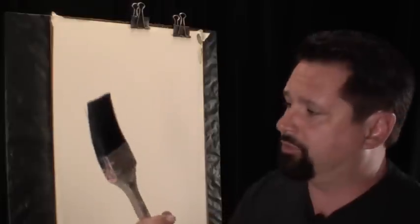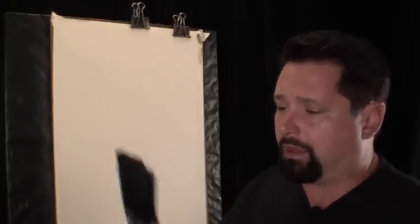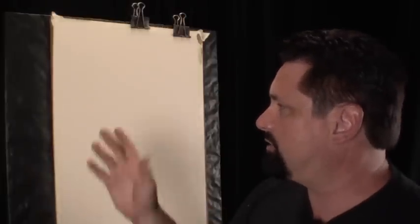Tools. Let's start with our black nylon bristle brush because we're using a water-based glaze. And black nylon bristle brush, for me, in my opinion, puts the glaze on a lot nicer and smoother and lets it just flow out versus these synthetic brushes or multi-purpose brushes. This brush, it's all I use for water-based products, and that's all they stay in.